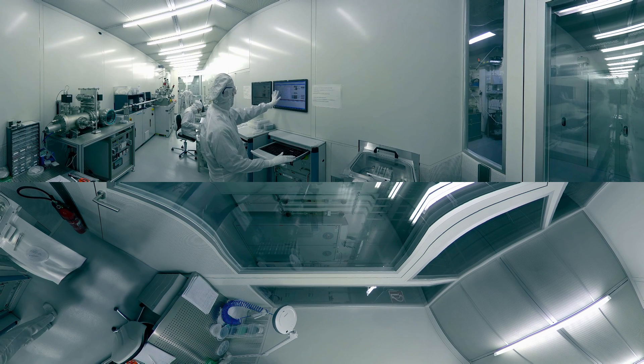The next layer is needed to guide the acoustic wave near the surface for high sensitivity of the sensor. An amorphous silicon dioxide layer of several microns is deposited by plasma enhanced chemical vapor deposition.